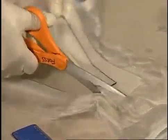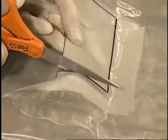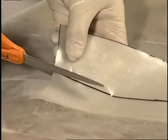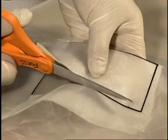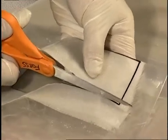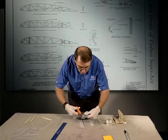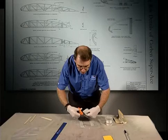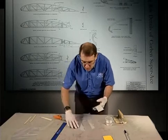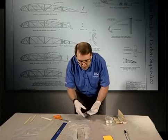The great thing about this process is it's very clean and neat — we don't have resin dripping out all over the place. It's a fantastic way to get a handle on using composites while optimizing the glass-to-resin ratio. With a typical hand layup we shoot for 50-50 glass to resin, but we can get 60-40 and sometimes even better than that.